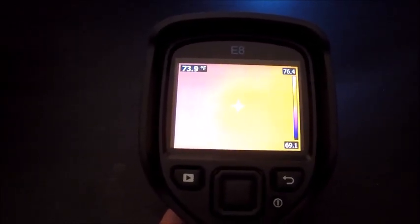On the bottom right is simply our on/off button. Try to avoid turning the camera off by pulling the battery out — it's really not designed to do that and it's not good for the camera. You're going to hold that button down to turn it off, and hold it for about a second or so to turn it back on.